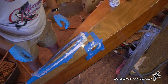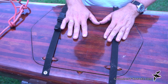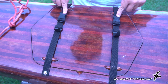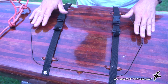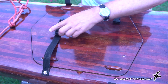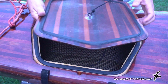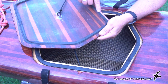We'll let that set up and it should be fine. So these large flat back deck hatches tend to be the hardest to keep dry. I've got some standoffs here that take the pressure from the straps and use that to compress the gasket. But it's such a wide flat surface it's hard to get down pressure on it, so I tend to use two gaskets on the back - a gasket on here as well as a gasket on here. What has happened with this gasket is it's moved a bit so it's no longer compressing all the way around.